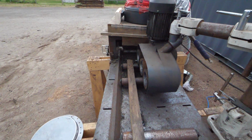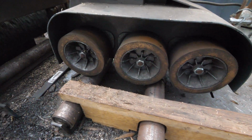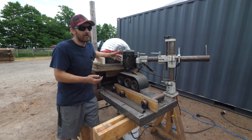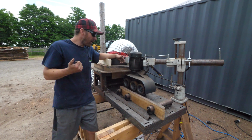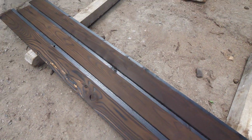It has an adjustable speed on it, which is really nice, so we can control how fast the wood's going through the machine. This lets us adjust the brushing level, which is basically one brush or two brushes. So we don't actually adjust the speed too often. It's more of a single brush or a double brush, depending what the customer wants. Every single one of our orders so far has been a single brush, so we should be good to go on this one.